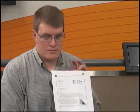That's right. So what sort of testing do you perform as part of the overall process in these environmental conditions? Well, Christian, like everybody else, we have a 5% document that we run. 5% document? We actually use this document here. It's an ISO standard business letter type of document. Now, ISO, International Standards Organization. Okay. And it's about 5% coverage. So 5% of the page is covered in toner. Okay, so 5% area coverage. That's right, 5% area coverage, sorry.